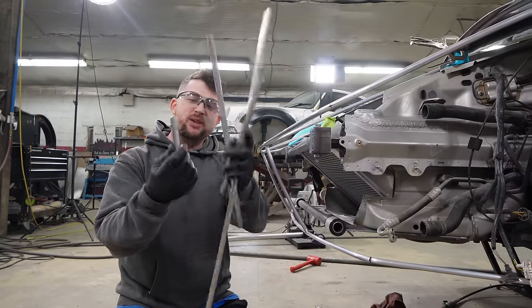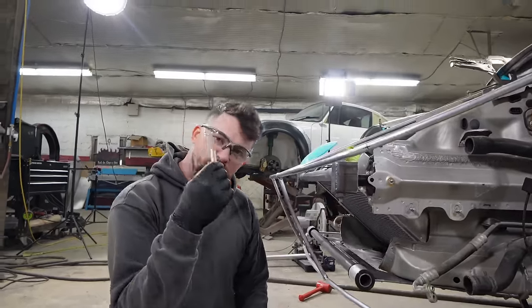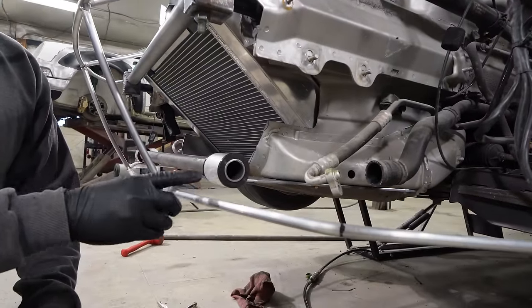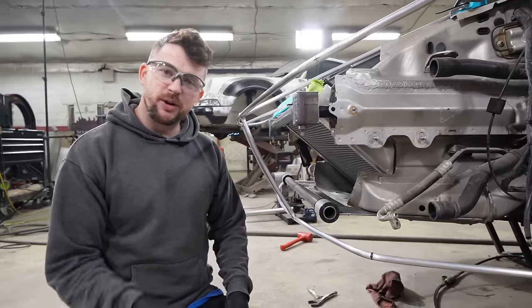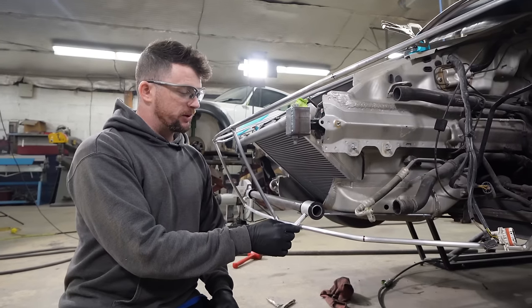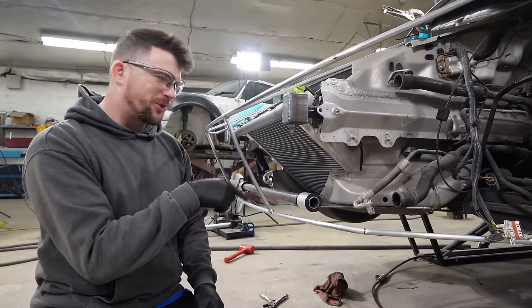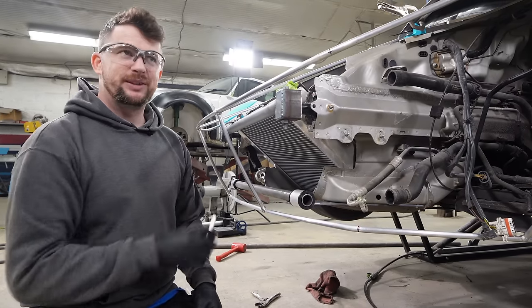So we're gonna take all these aluminum bits and bobs we have left over from making our framework, and turn them into struts that we're gonna weld to the body of the framework and go to the collar we made that's bushed to the steel hinge, essentially creating a hinge point that we can then open and close this clamshell without issue. And we need to figure out where we're gonna weld them to this framework because we don't even have our center intake fully designed yet, nor is it even here to build around. So we wanna make sure our framework kind of stays within some kind of tolerance there.